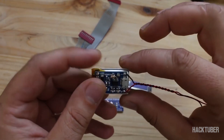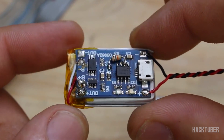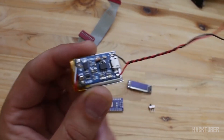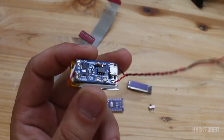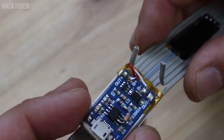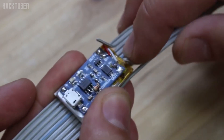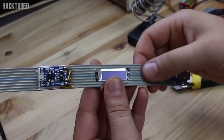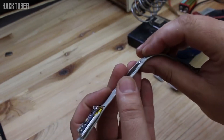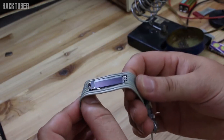I have this small lithium-ion battery and on it I have glued a charger module which is USB powered. If you use this charger board, it's good to replace the current resistor because by default it is set to charge the battery with one amp, which is huge. I have soldered a 10 kilo-ohm resistor so we can charge the battery with low current, which is the best way for a longer battery life. The circuit for powering this gadget goes: battery and charger, then to the main switch, which powers up the Arduino Nano and OLED screen.